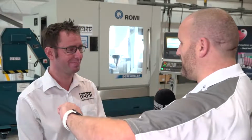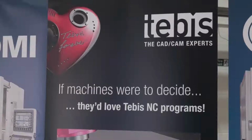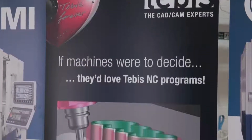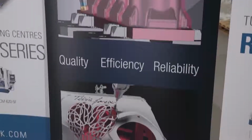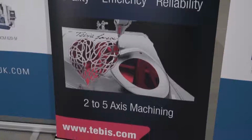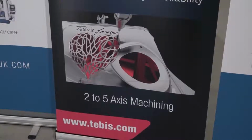Yeah, it's quite complicated, and with the one clearance, I can imagine the feed rate was pretty much zero when you proved that out, but that's the beauty of predicting collisions. Yeah, definitely. Some of our customers don't have windows in the machine, so you can imagine they use our simulation package to collision check everything before they run the part on the machine. For me, it's a big help because we go from different machines to ROMI to Mazak and all different types of machines. So for me, it's a safe bet when we're running a simulator.